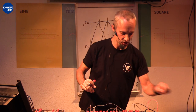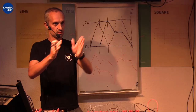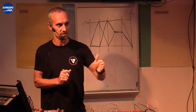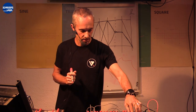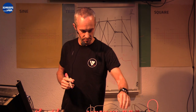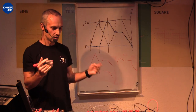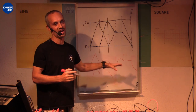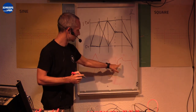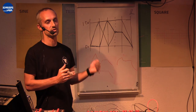And in the multi-envelope, the shape control does that because internally it's crossfading. Each step is crossfading from something to something else. And that control is actually affecting the ramp oscillator that's acting to control the crossfader. So we don't have an oscilloscope to show it here, but you just have to trust me that when we do something with this module, and then we crossfade to add an extra stage or to do some other process, it actually continues to have curves that are in line under control, with this control going from linear ramps all the way up to full-on deep exponential curves that these crossfaded ones also follow in the right way.